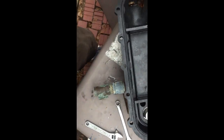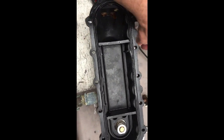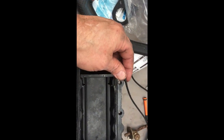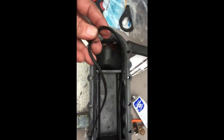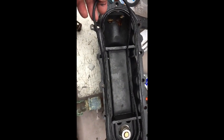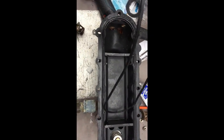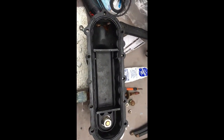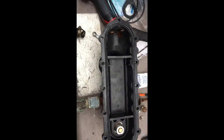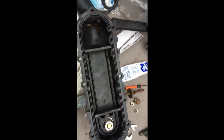We're also going to replace this gasket here with a brand new gasket so it'll seal up nicely. I've got the gasket replaced — this old one is super flat. I noticed that at one point I was getting some water leaking out of here when I had the spa isolated. Got the new one in with some sanitary gel lubricant on it. Now we're ready to reinstall this thing carefully so as not to lose any of those nuts.